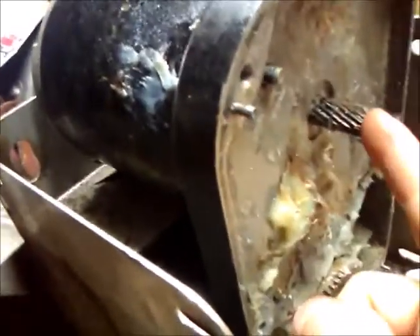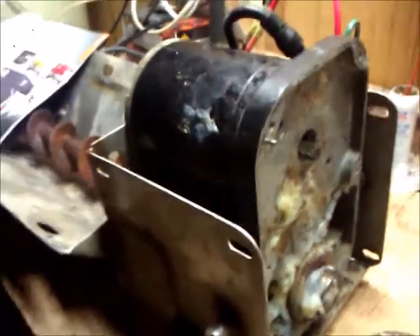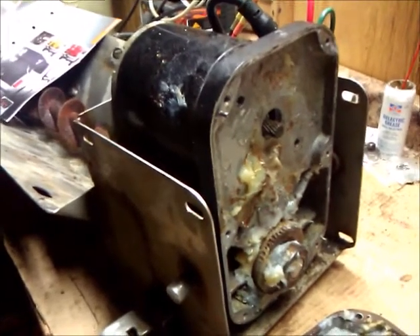The big problem is that there's not enough space from the factory to get this spline through that hole — there's not very much tolerance, about half an inch. The problem is the front of the motor is an inch. So even though I've got the motor loose and that was fairly easy, as we pull the motor out there's just not enough space to get that shaft out of the hole because the motor comes up against the frame and gets stopped. So Salt Dog wins — this motor is probably specialty, which is why they don't sell it independently.